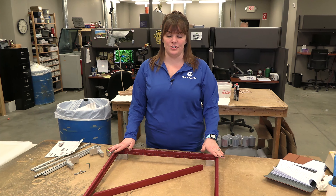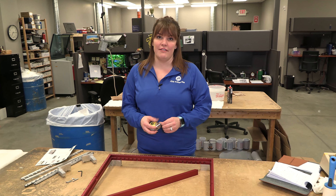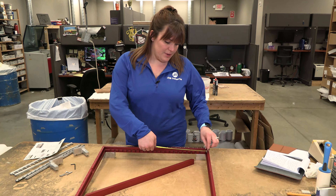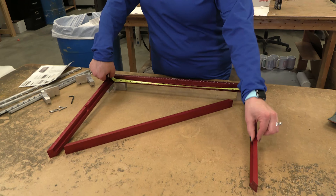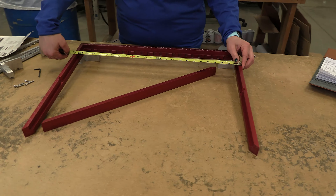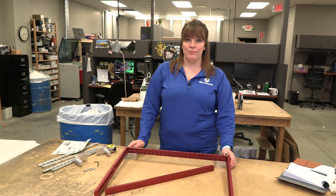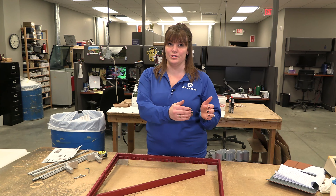You don't necessarily need the frame to fit your whole laser bed. Good thing to note is that when we have our sizes as the 12 by 24 or 18 by 24, it's going to be from center to center — that's your 24 inches. This frame here adds another half inch, so it's essentially 25 inches that you're going to want to fit into your laser. Making sure you have enough room is very important so the whole frame can sit right up against your rulers.